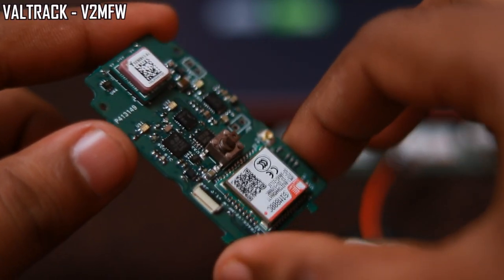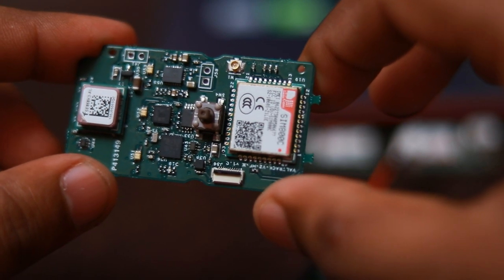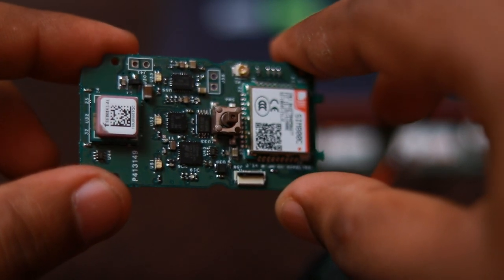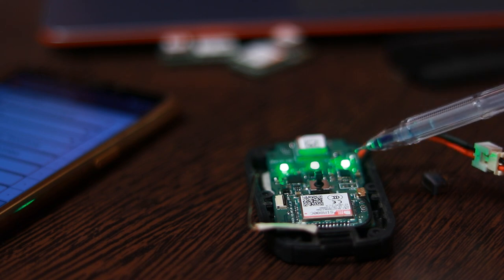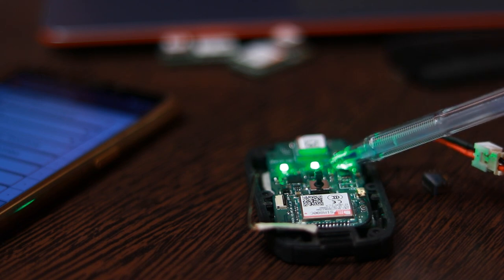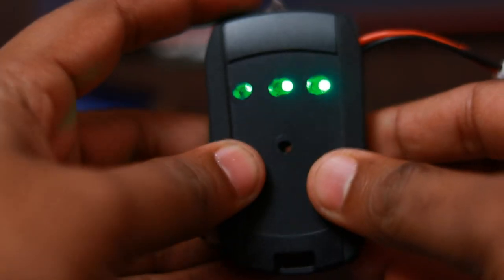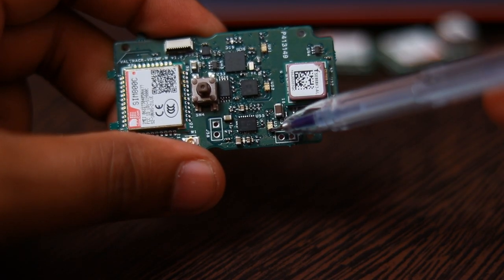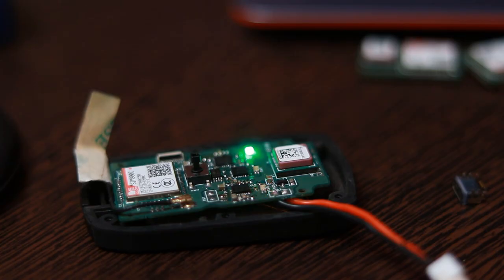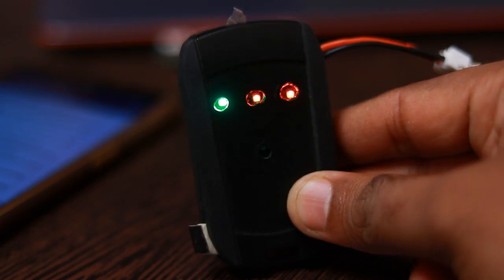This design is named V2MF-W. Since we are designing a consumer product, we need to have some indicators and interfaces for the user to easily understand. In this effort we have added RGB LEDs which will work as a battery indicator, signal indicator, and GPS location fix status indicator. Since 3 LED color combinations are possible, we can implement a lot of feedback options for the user. There will be a cutout in the top lid of the enclosure to have good visibility of these LEDs. These LEDs are controlled by an I2C IO extender so that we can offload the MCU from the trivial task of blinking LEDs and changing their colors.